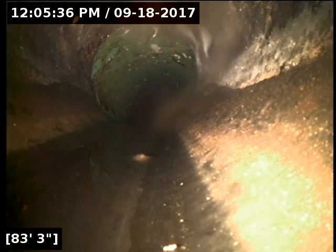All right, well, I was unable to locate the camera head here as well, but I did pick it up very strongly, only about 10 feet behind where we're sitting at currently, which again was only about 10 feet from the street. So the line's not making any hard turns, so 100 feet out would put us about 20 feet out into the road.